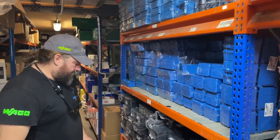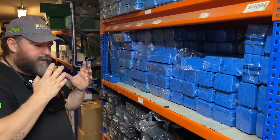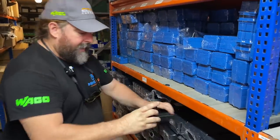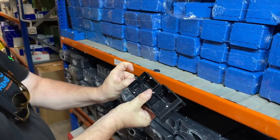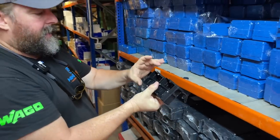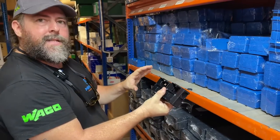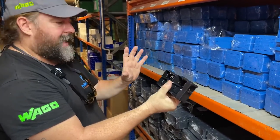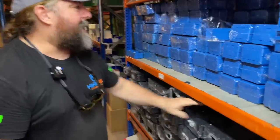Okay. The different voltages. What we normally do when we've got a quadruple socket or a double socket, we put these together. For a double socket, we put another box by the side and two other sockets for telephone and fibre or data. And then the centre socket, to keep the distances apart throughout the house, we normally get that one plastered. Asking the plasterer to fill it? Yes, we ask and it's normally done.